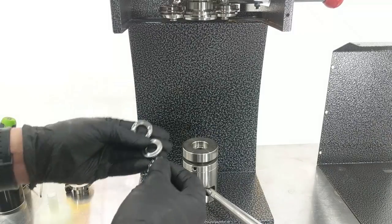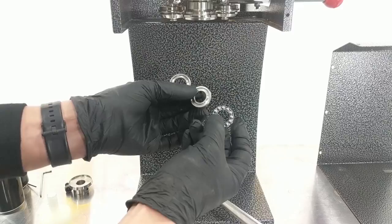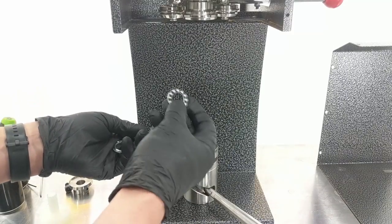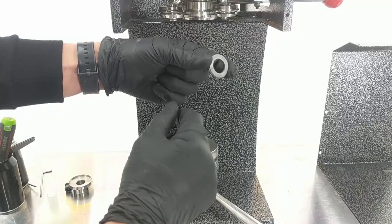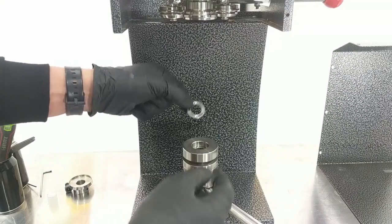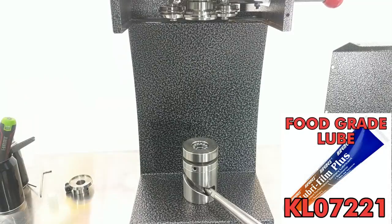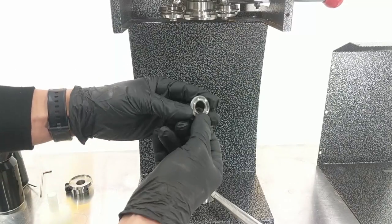The first thing I'm going to show you is about the table and how to make table adjustments. When you get the machine there's a three-piece bearing set that goes in there — we made it three-piece so it can be easily taken apart for cleaning. This piece is made from hardened steel rather than stainless because the bearing race assembly lasts longer in hardened steel. The flat piece goes dimple-facing-upward, then the bearing race on top with a bit of grease — we use Haynes Lubrifilm — and then the top piece with the dimple side facing toward the bearings.